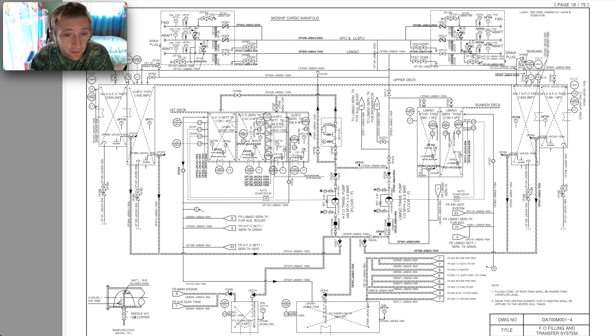I don't know how they made these calculations. Probably there were some, because if there is no higher pressure, all the fuel would pass back down the line. There is a solution that was selected: a non-return valve placed on the line coming from the transfer pump — you can see it here on our drawing. The fuel goes one way and not the other. But this is not a safe solution, because one day this valve can break, and these valves do not always work properly.